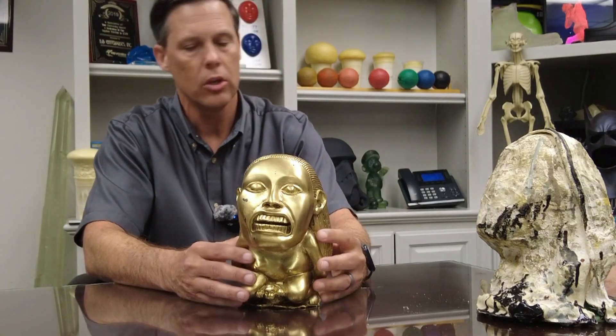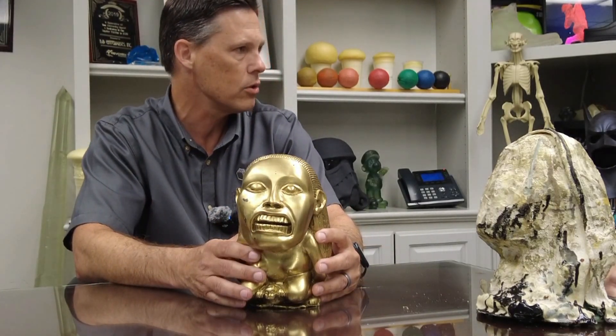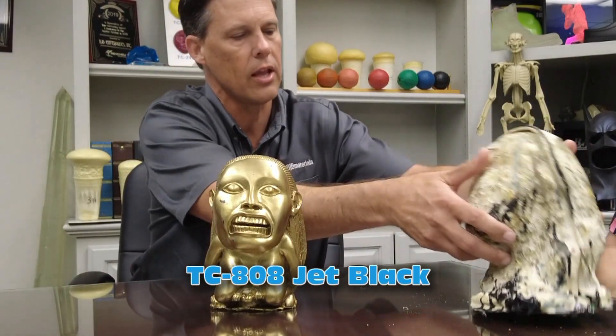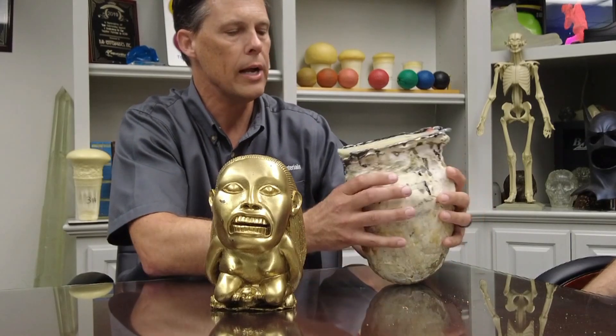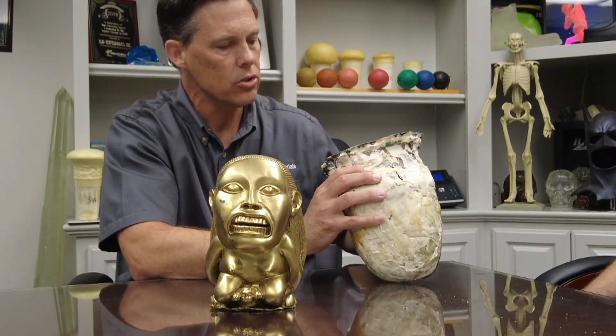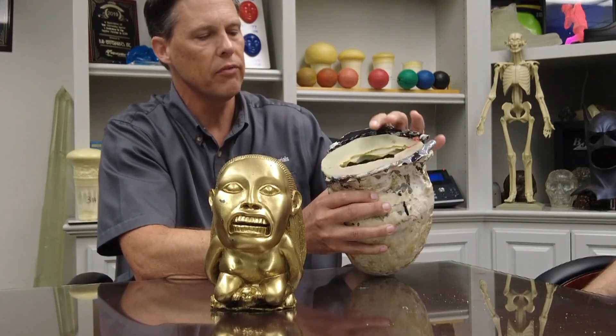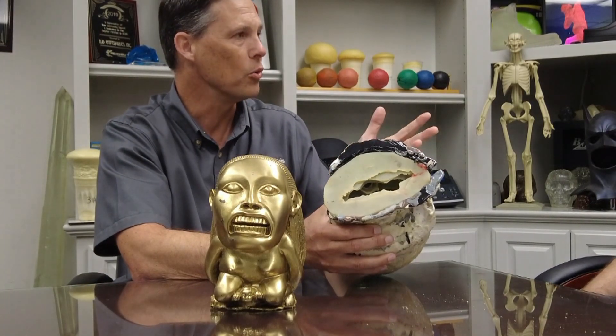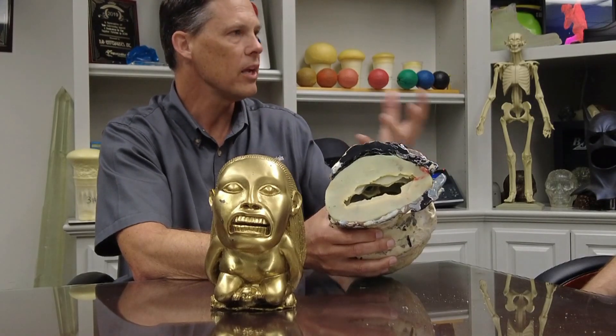Something like this — I don't think you need to go that route. You told me this was out of TC808 jet black, yes? So along that line of logic, you've got this mold and it doesn't look too bad. But one thing that happens is if there has been a variety of other materials cast in here, sometimes a different material might lock onto that — finding something within that silicone material, plasticizers or whatever, and it'll actually lock on.